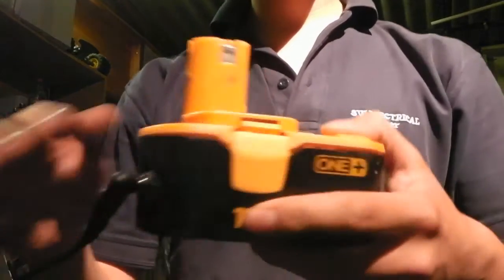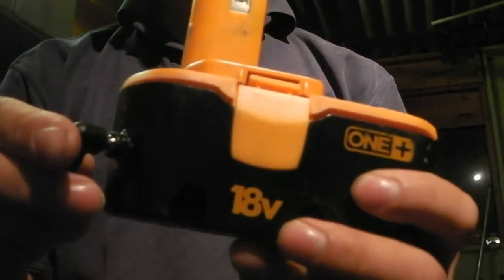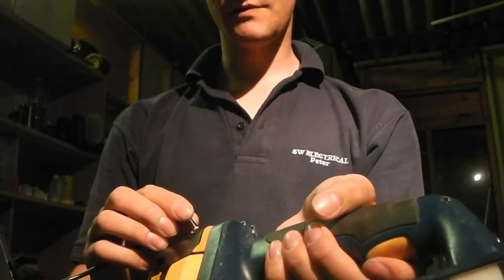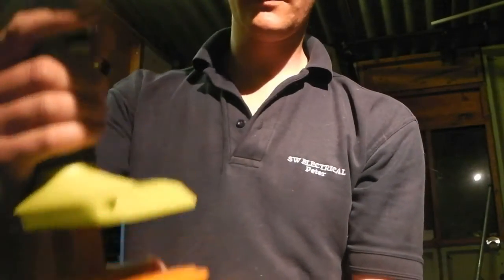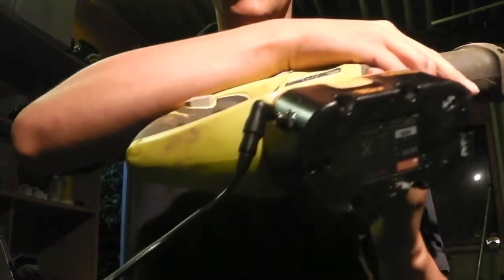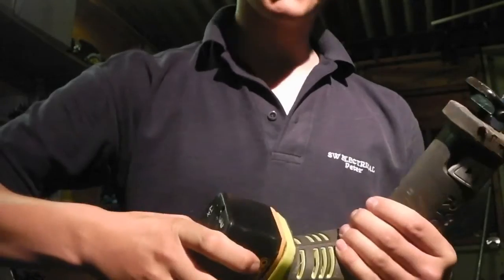So here we have the finished product: the empty Ryobi battery shell with the plug on the back, all soldered together. When I insert the power supply, we have voltage. I'll just show it on a couple of things to prove it works. You can use it on your lantern — unplug it and it goes off — just to prove this isn't just a normal Ryobi battery. Plug it into a drill — it works. Plug it into a saw, which I made this for — plugged in, proves it works. If anything, it's slightly underpowered and slightly fragile.